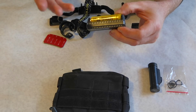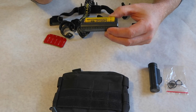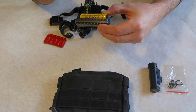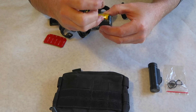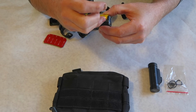As the battery gets older, it's going to be 4.1, 4.2, but it'll blink 4 times with one of the LEDs. It'll pause, and then the other one will blink, from 0 to 9. So 4.2 would be 4 blinks on the one side, a pause, and then 2 blinks with the other LED.